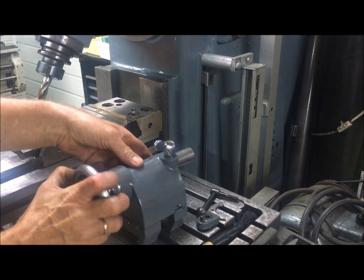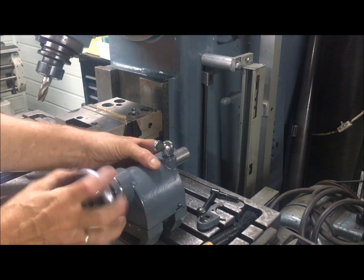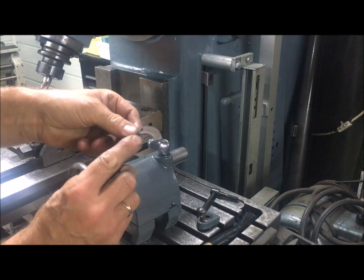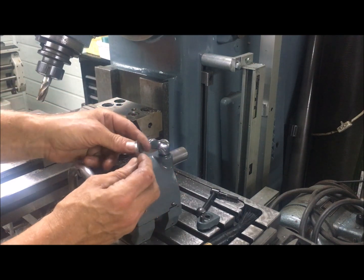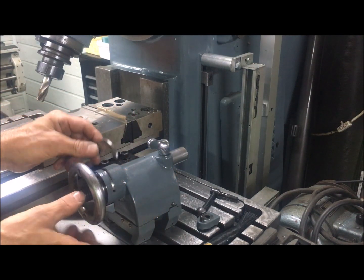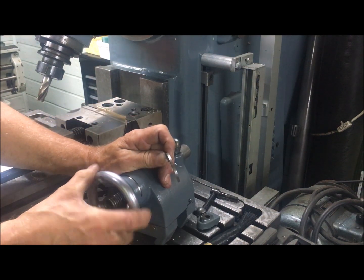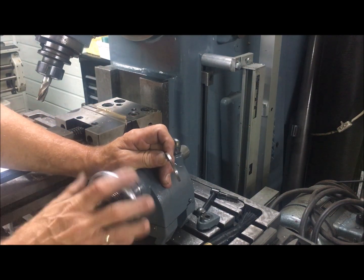This is the ML10 headstock. I also took the time to snug it up, namely to make new spacers that go in here, because this was sloppy, and now this has been fixed, so it's snug again.